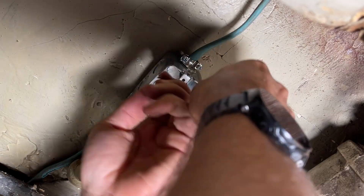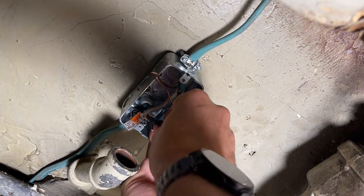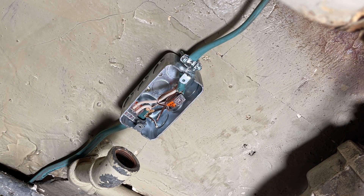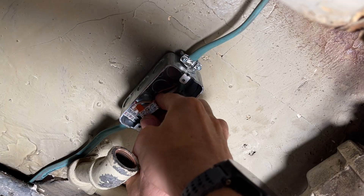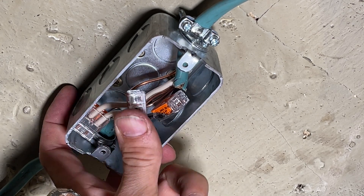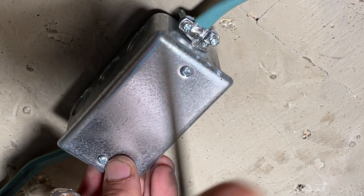Now if you don't have enough wire, you can make small extensions. Since I do have a little extra wire, I'm just going to use the two-pin to tie together that hot side. And then for the ground, since we will be grounding this metal handy box, I will need a three-pin Wago, which will tie the left and right hand side together and also the ground going to the handy box. Close that out, tuck in your ground, and now everything is completed — all we have to do is put on our cover.